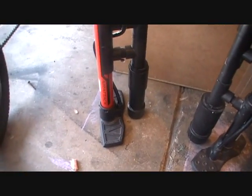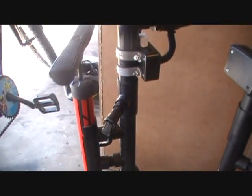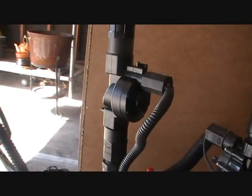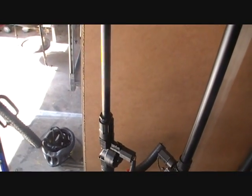This one here is the last one we made. My son and I made it just this past summer. I'll put it up on a table to show you later. It's the same setup — 9-volt battery, with an arm handle extension and a red push-button. This is an Orbit sprinkler valve. They're all one-inch, but this one has a half-inch PVC pipe barrel screwed into it — perfect for mini marshmallows, baby carrots, and stuff like that. It will flatten a mini marshmallow as flat as a piece of paper at 90 pounds of pressure.